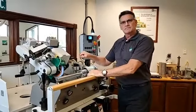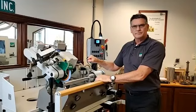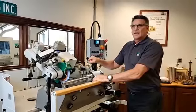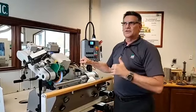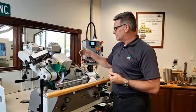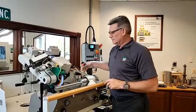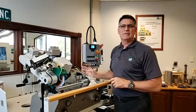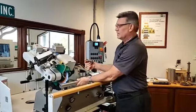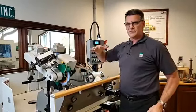Okay, there's a question. Cody says, even with regular greasing, when I lower the grinding angle, it stutters as it moves. Is there a way to fix this easily? If it stutters when it's moving, when it's going down, even with full greasing, a lot of times, we'll get a little bit deeper into that shortly, but there's some bolts over here on the side that we can make some minor adjustments with to allow a little more freedom of that movement. But what we also have to watch for is getting those too loose to where it allows the aggregate itself to move. So there's a fine line there.